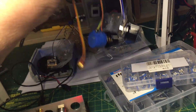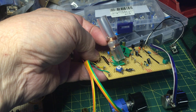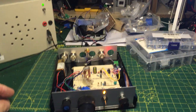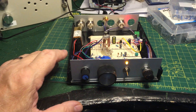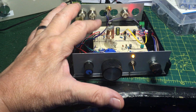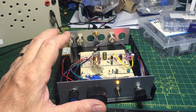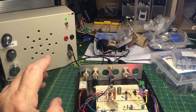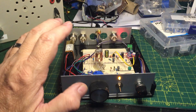I have made another one which is over here, which is in the prototype stage. It's got a 20-meter coil on it. I sort of did it by trial and error to get it to 20 meters. But there is a software program you can get for Windows that will calculate the amount of turns you need for the size of former that you're using. That one does receive the 20-meter band, but it doesn't seem to come in very strong at the moment, so a little bit more work needed on that one. But this one works really well.